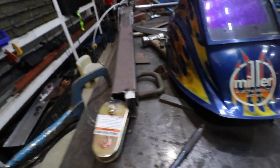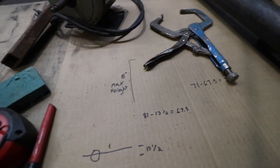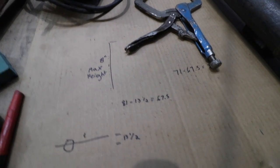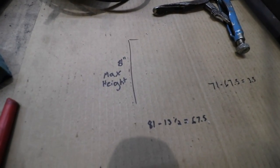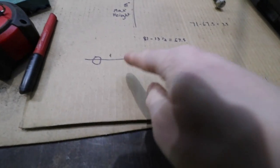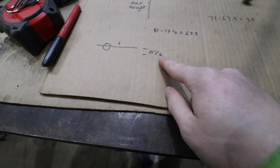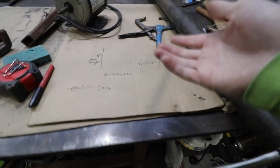This really still needs a D-ring but I'm not going to do that right now — I'm just going to try and get this sucker mounted. One thing I do have to be cognizant of is making sure I have enough clearance to pull this into the garage, because I'd really like this to be towed by the lawn mower and pulled directly in the garage. So I took my tape measure — maximum clearance of my garage is 81 inches. The trailer is sitting level on the ground, and from the ground up to where that plate sits on the trailer, we have 13 and a half inches. I'm trying to figure out how much of this pipe I'm going to have to cut off.